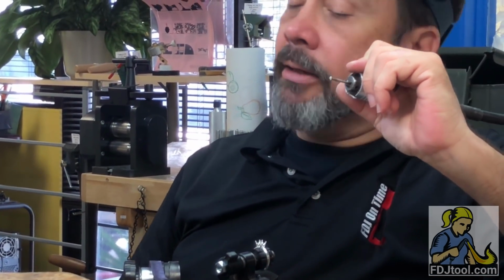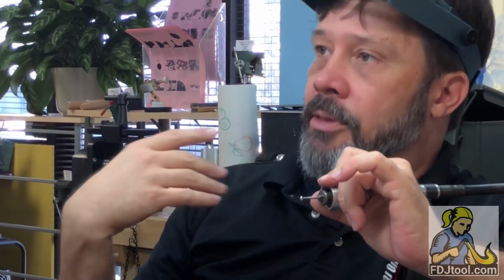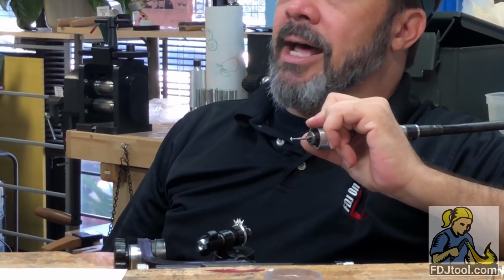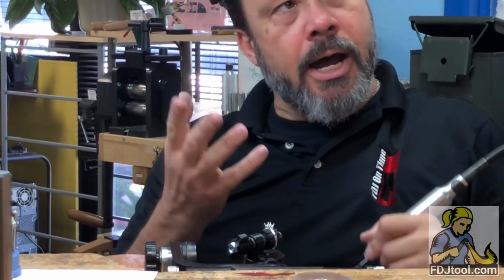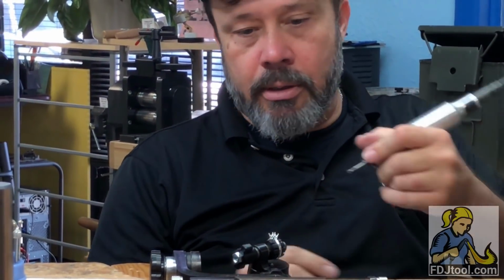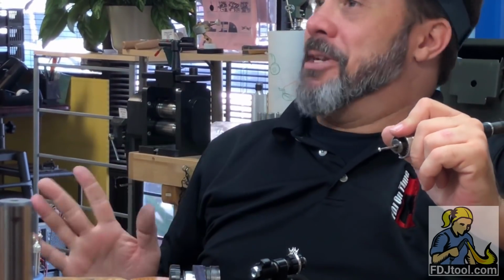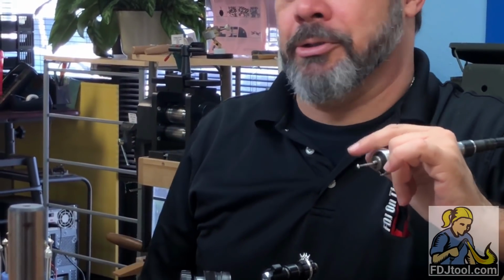There's a gentleman online that suggests if you have a reversible motor that you actually run the burr in reverse, with the teeth against the way it should be cutting. It cuts much slower. It's not as effective, but it's far, far more controllable. So you can get a really nice notch and the shape that you want. I know that's probably going to make some people squirm, that you're not doing it the right way, but I have tried it, and it works like a charm.